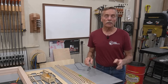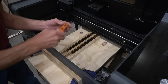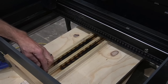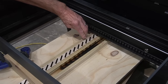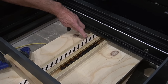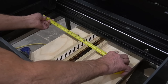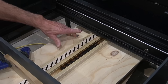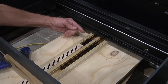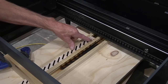The slots in the fixture are perfectly perpendicular to the x-axis, so when I put a piece in place, the cuts will be lined up with the edges and slots will be centered in the piece. But I still need to tell the laser where this edge is — I want that edge to be exactly at 10 inches. The laser knows where 10 inches is but I don't, because there's nothing to measure from inside the laser to that point. And for reference marks, a pencil mark isn't accurate enough — I need alignment within a couple thousandths of an inch, and that red mark itself is a few thousandths thick.